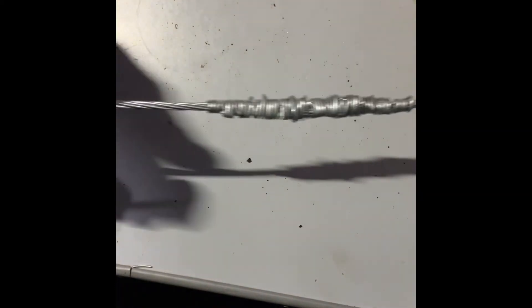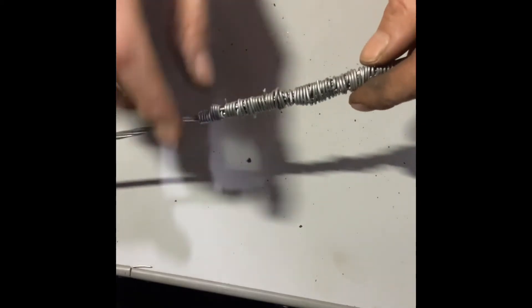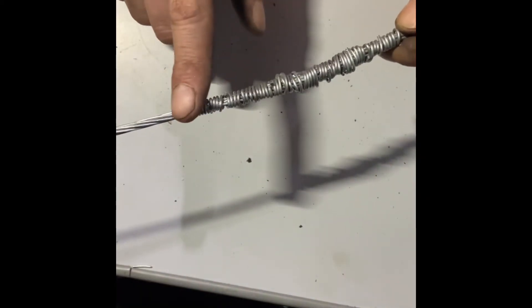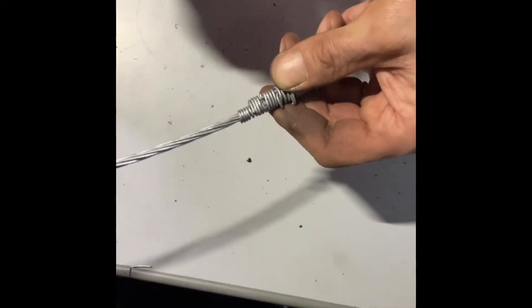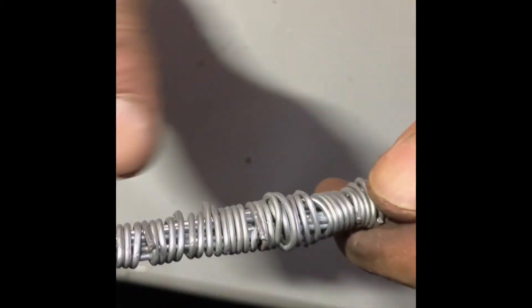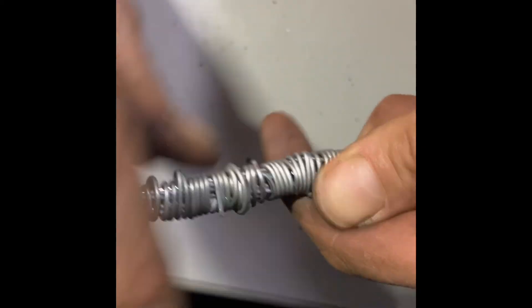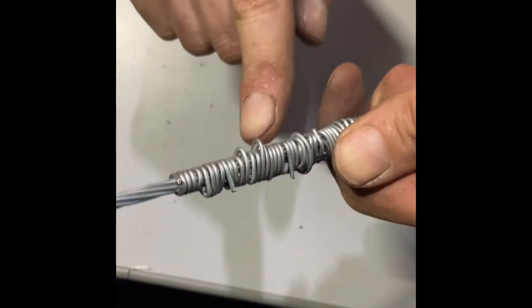Once you've got about two or three wraps on each side it is hard enough to pull the signal off — but it needs those few to bite into each other. We've done the line joint here, with a second joint where we've joined the other piece of wire together. I've managed a fairly small joint — about four inches wide — normally it would be about six inches. You want about a foot of spare wire to do the wraps properly. Keep them as close together as possible; if you don't, they start to come out and bubble up, which is not neat at all.